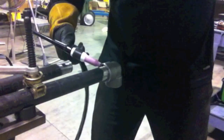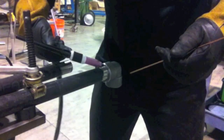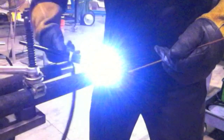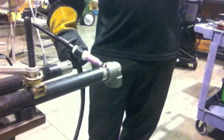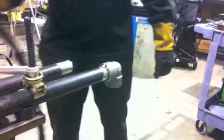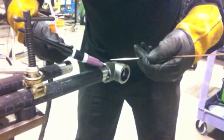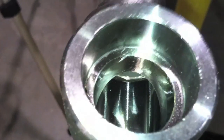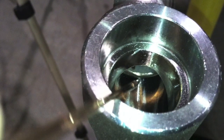You can always put a straight edge on each side to get them straight. I'm using a lift arc TIG machine today with just a torch switch, which means I have to touch off to get the arc going. I prefer high frequency whenever I can, but I'm just playing around with this unit — no foot control, just the amperage preset on the machine. Once those two tacks are on, I get a couple more for a total of four tacks, and you can see I've got roughly a 1/16th gap inside there.